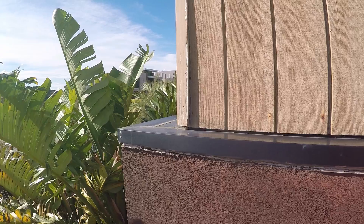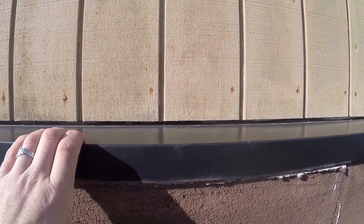We're facing north-northwest, which means we're going to get a lot of sun all day long. We need to make sure that the fixings are not going to rust, absorb too much water, and then start to pop. This is why I'm saying, Flora, you need to be making sure that you go to the nth degree to prepare the house properly before you paint. And once you paint it, you need to make sure that it's done on a regular basis to stop any bubbling. We can see the damage that the rust is doing to these nails — it's popping the external cladding off the wall.